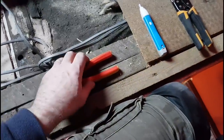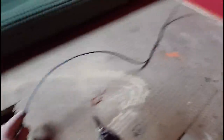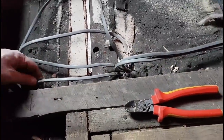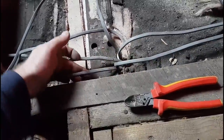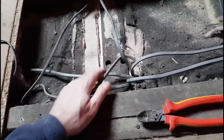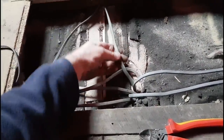Perched on the side of the loft hatch on the ladders, you can see the cables coming up through the original door casing — that's how they used to run cable routes. This cable here goes to one bedroom, and I've fixed up the other one for the other bedroom. There's a gang of cables here: three 1.5mm cables — your bedroom light switch, your bedroom light switch, bathroom, and landing. The landing has two cables on it as it's a two-way light switch. There's also a 2.5mm cable that's still live, so we'll make sure all the power is off before digging around in there.